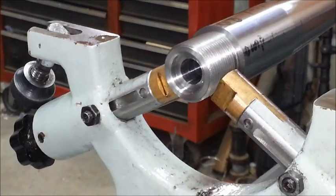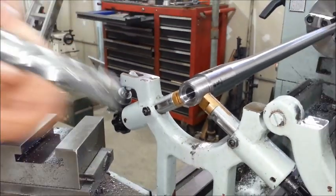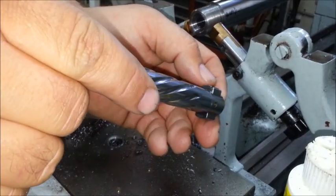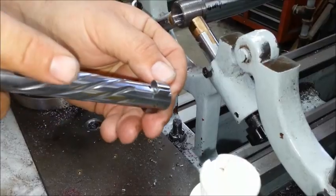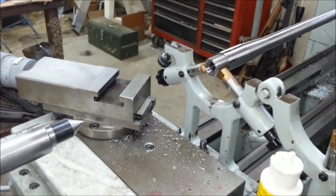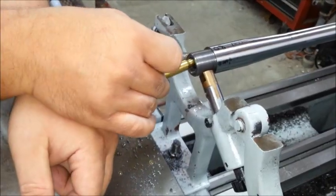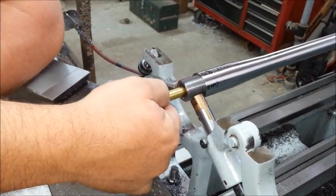If you think that the two little lugs that hang off the backside of your bolt are what actually holds it closed under 60,000 to 80,000 PSI in a couple milliseconds — that's actually a very small part of it. What people don't realize is that when the gun goes off, the brass casing swells up and actually adheres to the inside of the chamber. So there's one more thing keeping it from squeezing right out the back.